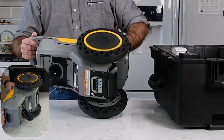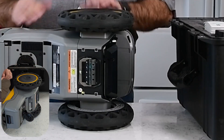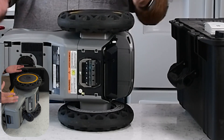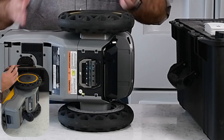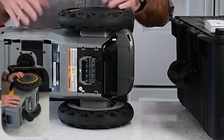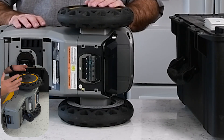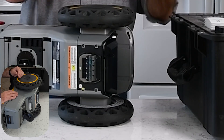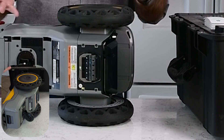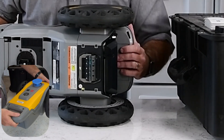Looking at the underside of the unit, this is where the print head is. You can see it has several different nozzles, so it's able to print lines, curves, and text. We can add a lot more detail to a job site — not just a wall line, but door openings, and labels like a room label. For mechanical work, we can actually print points out as well and put text alongside that describes what it is. That visualization is a big part of the advantage of using a device like this.